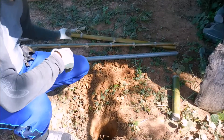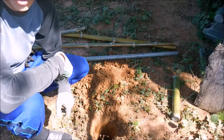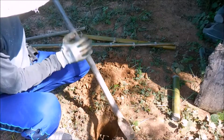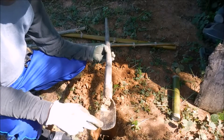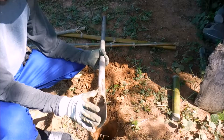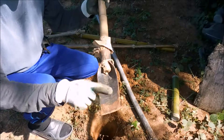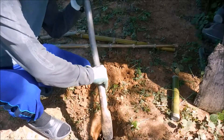And to dig the hole — be prepared to have a bit of time to do this. You're doing this properly one time, no mucking around. No stakes in the ground which are going to rip out the next time you have a storm or strong wind. Dig a fairly deep hole; it only has to be narrow. In Thailand we've got a perfect tool for that — it's like a spade on a long pole. This one's fully steel so it's strong. Quite often you get this end part on a piece of bamboo, which I've got right here. You buy these spades from hardware stores. I'm just going to use the full steel one.